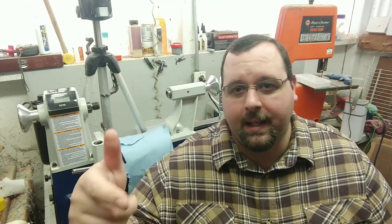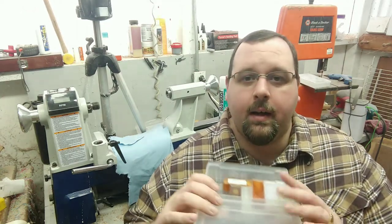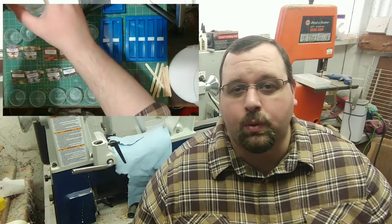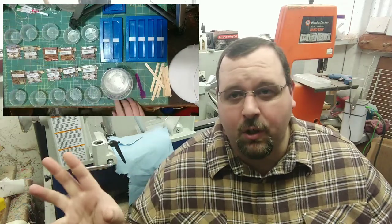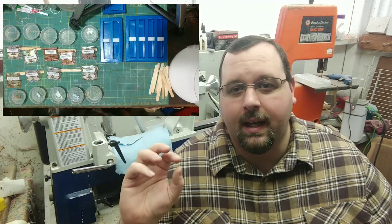The pressure pot rack is actually really easy to set up and it fits beautifully. I got that set up because the next step was casting all these up. I made some little HDPE spacers so I could cast up two blanks per length — full length blanks — and separate them so I could do two individual colors per blank slot in the P-Town Subby molds that I got. I've got now ten of these blanks and they turned out pretty spectacularly. I'm really happy with them. The molds worked really well, and I did use mold release on it.